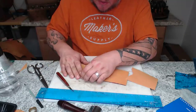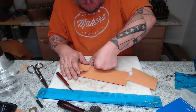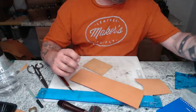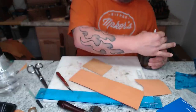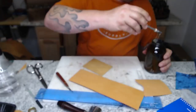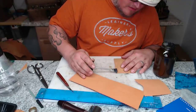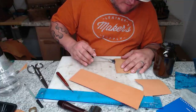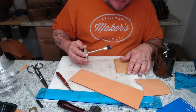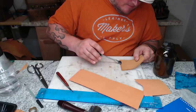Do the exact same thing on this side. Now, I'm going to take my jar of contact cement, and on only three sides, I'm just barely going to put a little bit along the very edge here. I'm going to try to make it 3/16 of an inch, almost a quarter of an inch. There is some play in this pattern, but not a ton.